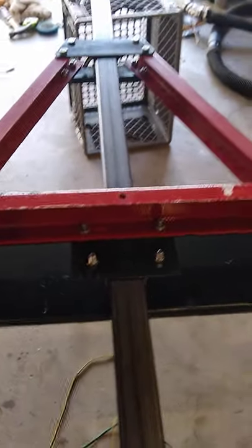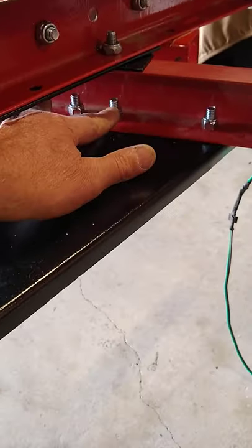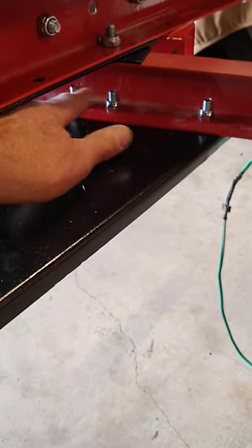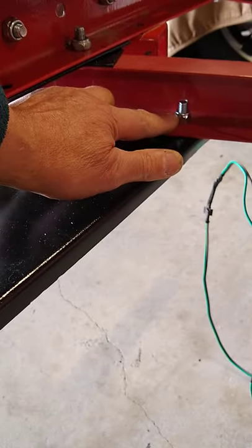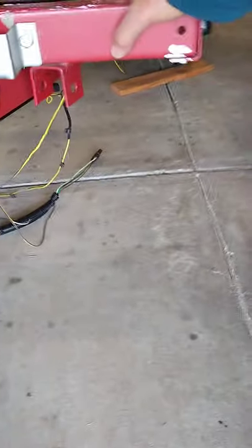The side-to-side motion ties the a-frame back together really well. I put in three bolts on each side going to the crossmember — these bolt holes were already there on the a-frame and I added a third one back here. This adds a lot of rigidity; in fact, this whole setup with the a-frame and the tongue going through it just makes this thing so much more sturdy and stout. It doesn't bounce anywhere like it did before, so I'm real pleased with that.